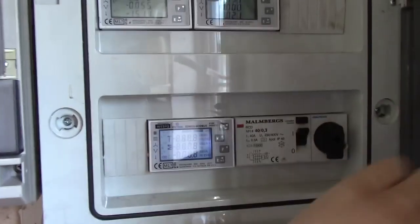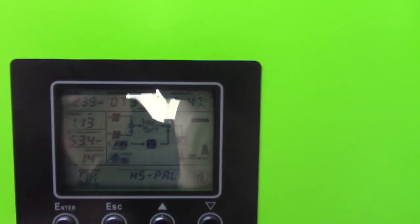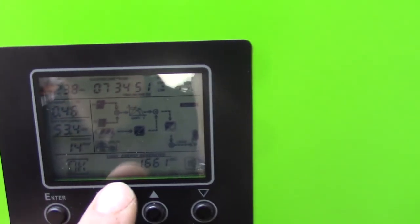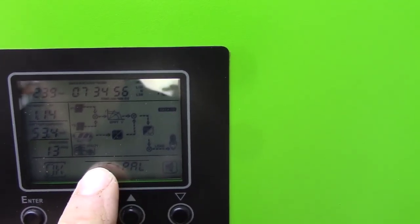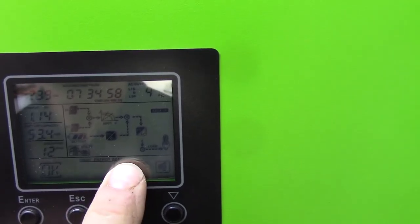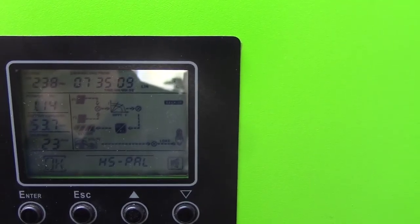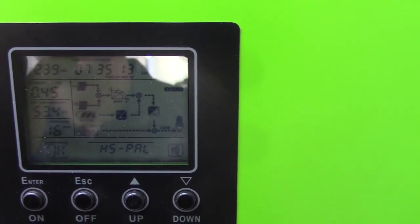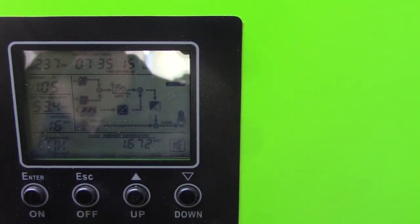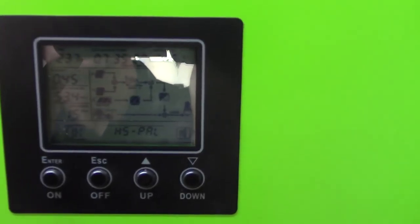So let's turn the grid on again — and now my inverter will start the synchronization. The inverter is now synchronizing the grid power; it's a little bit hard to see but you can see it there. There's no link between those yet, and it will in a couple of seconds go up to the grid instead. And there it switched over to grid, and it will soon start up the normal phase as well. Unfortunately this lamp in here always blinks — that's just the nature of it.